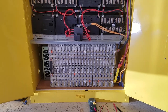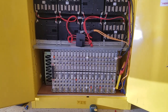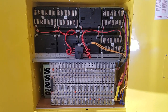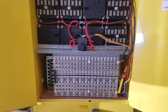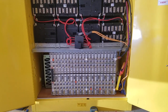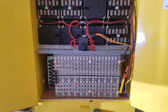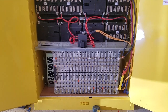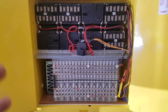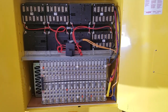I put it in this cabinet and I could extend my battery bank as much as I want, but unfortunately you can only use what you actually produce. I can't add any more array to my system — it's going to be stuck at 4 kilowatts, no more space unless I go up to my roof, which I won't. So no more solar array, only 4 kilowatts solar, and it doesn't matter how big the battery bank is if the solar can't fully charge it back up.